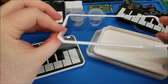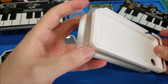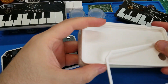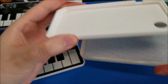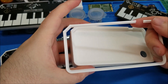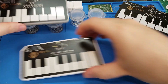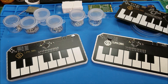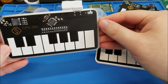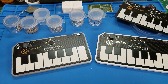I should have started by printing out more of these template pieces to make sure I got measurements right before printing out the full cases — now I've wasted a significant amount of plastic. I'll probably end up gluing something in the holes and using them as part trays because the general shape is still useful. But it would have been better to print more templates first. That's something I'm still learning about 3D printing — getting tolerances correct and having enough wiggle room while keeping things firm enough that they don't just pop out.